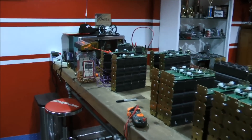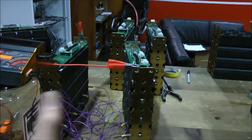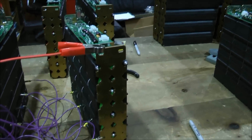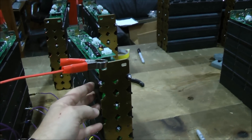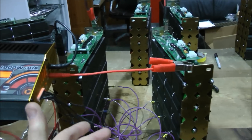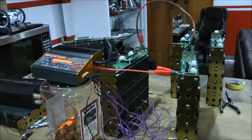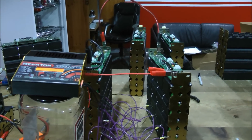We are now in the last step of what we need to do manually to get this battery ready for assembly. As you saw earlier, we put these modules in clusters of four in parallel and gave them a big crude hard charge. Now we're using the BMS's ability to go in and balance — to monitor each row of cells in series. This cluster of wires allows us to monitor each row of series inside the module. The charger looks at charge levels in each row, and when it sees one that's higher, it burns off some of that energy, then applies a little more to the other rows until all rows are balanced at 3.6 volts. That allows us to start off with a perfectly balanced battery. The VoltaBox BMS and charging system will take care of that forever afterwards, but we want to start off with a perfectly balanced pack.